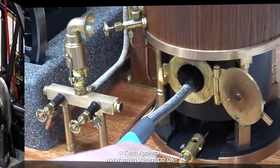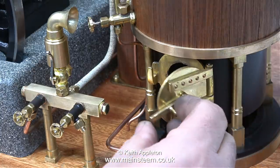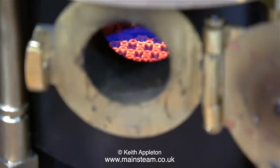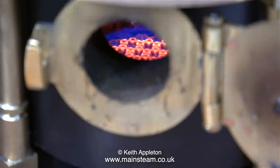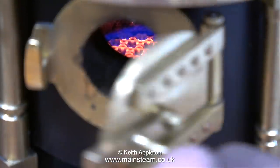Time to give it a steam test. With a commercial gas tank connected at one end of the pipe, I lit the burner. And I adjusted the position of the gas jet in the Venturi tube so that I got a lot of little blue triangles on top of the burner. The burner's starting to glow red now, but there's still some blue visible. If the position of the gas jet is set incorrectly, these type of burners tend to burn out.